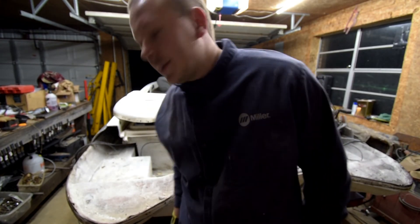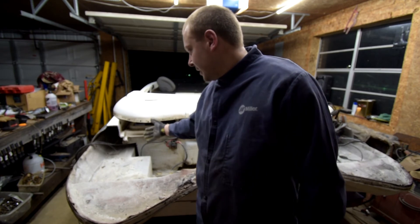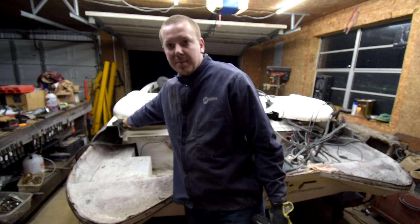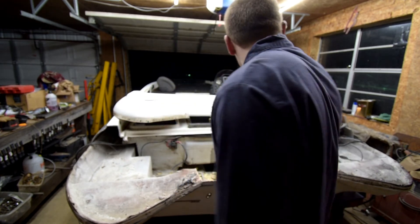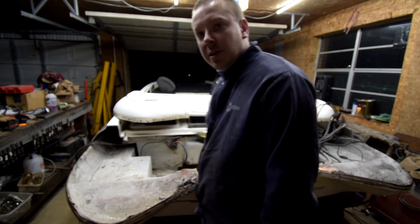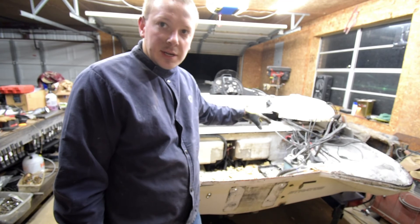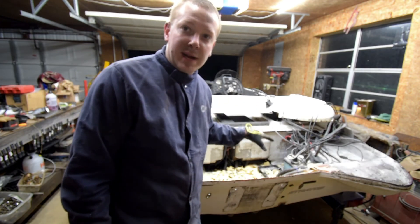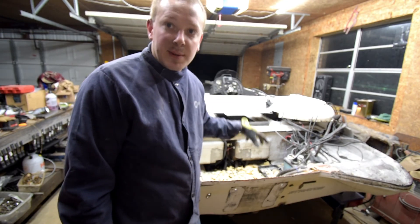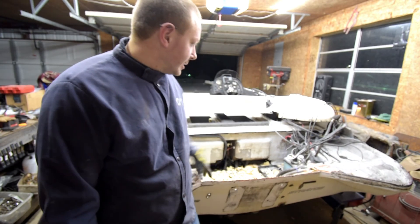That pretty well cures me having to get down in the back of this boat. I didn't think I would do that, but I got in here and got to looking at this. It's actually super simple to fix — grind this down back about six inches, lay in some new glass on each side. I specifically cut around the hoses and everything over here. There's a bunch of wiring right here that I want to get straightened out. To build this transom back as good as I possibly can — for my safety and the well-being of the boat and everybody else — I did what I had to do.